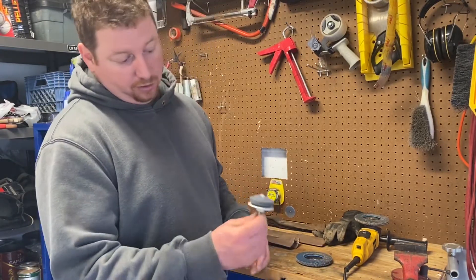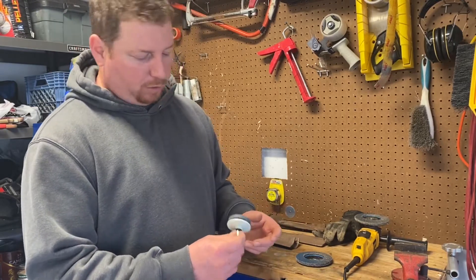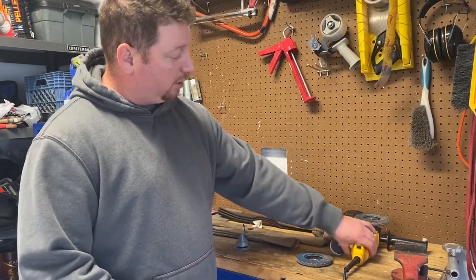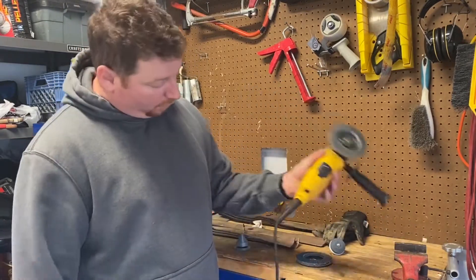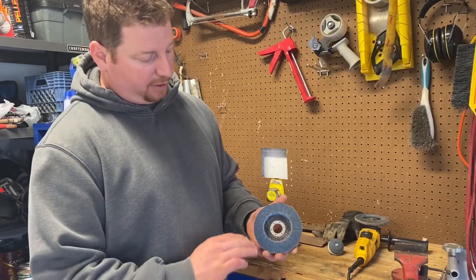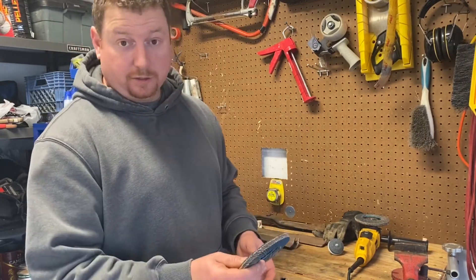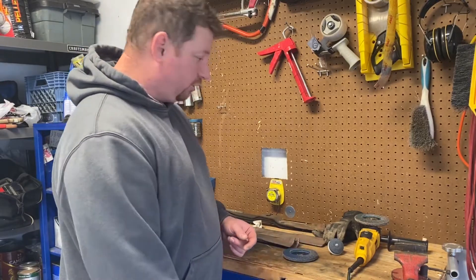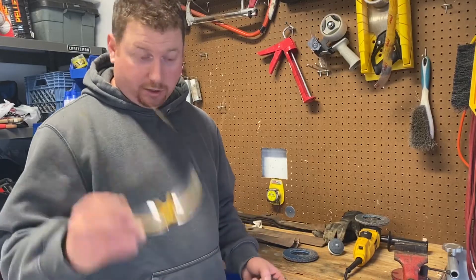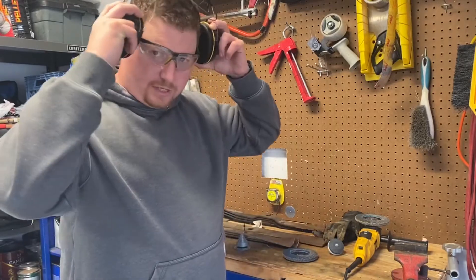When I bought the kit, it came with a bit stone sharpening stone that goes onto a drill. I think that would take a long time. I prefer a four-inch grinder with a petal disc — kind of like sandpaper, and as you wear things off you always get a new fine surface. These things do a really good job. A couple of things before we get started: wear your eye and ear protection when you're doing this stuff, because it's just not worth it.